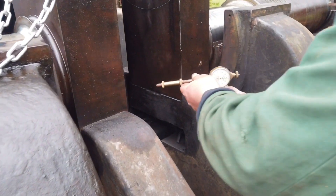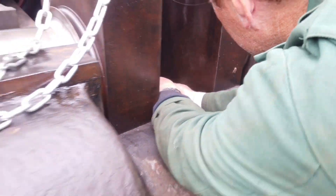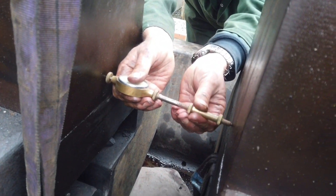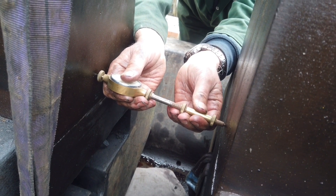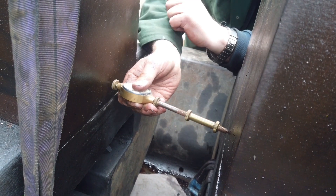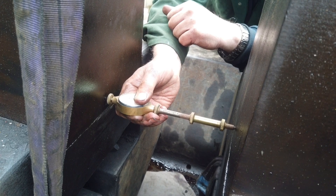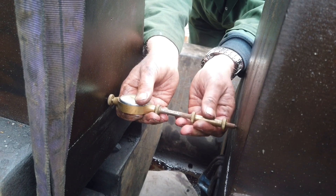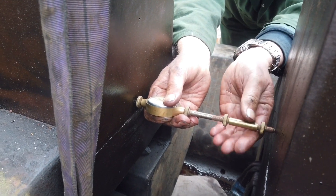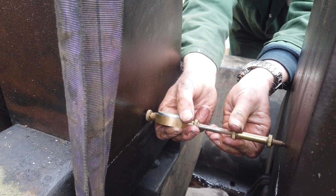We shall now fit the web clock, or deflection gauge. You adjust the extension parts so they're just a bit loaded, and you can fine-adjust with that little thumb wheel there. Spin it round a few times to make sure it's bedded into the dimples, then set it at zero.